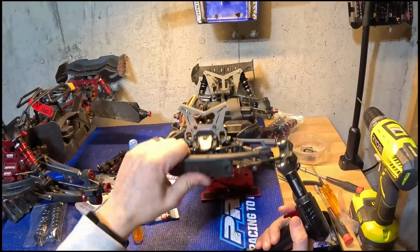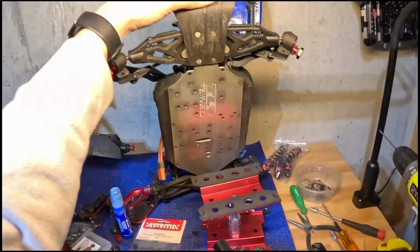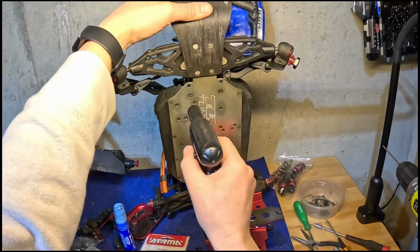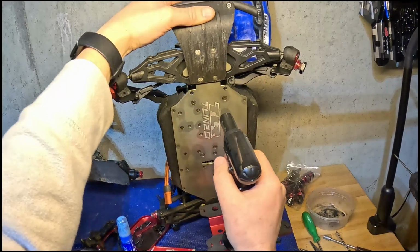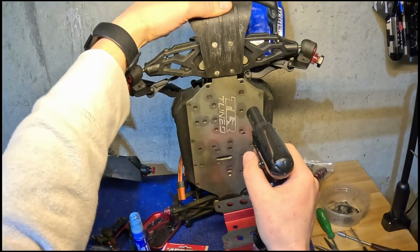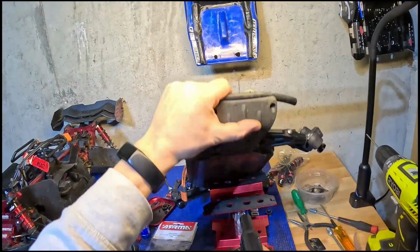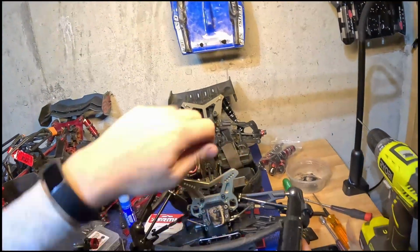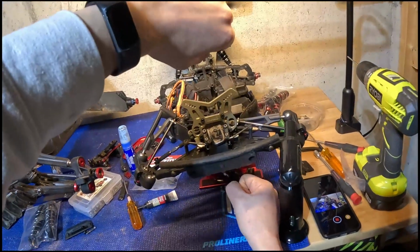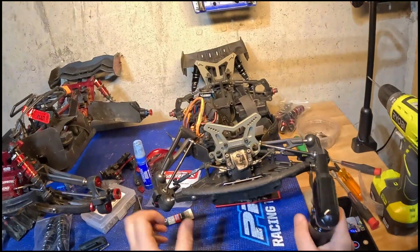So all you do is light it. Let's say you're trying to get these two screws off. You would just simply light it and torch that area, torch for a good minute or two, and that's going to basically boil the thread locker and loosen it up. And once you have those good and hot, then you're going to just simply take both ends, get a driver on both ends, and they should come off fairly easily.